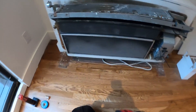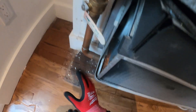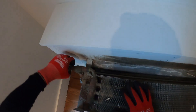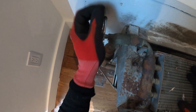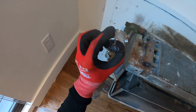The first thing you want to do is close your valves. Right now in this position the valves are closed; if it was facing up it would be open. Close the valves, let everything drain — you can open this one to let water pass down. Then we can start to unscrew the valve, spin it by hand carefully, and it's out — simple as that.